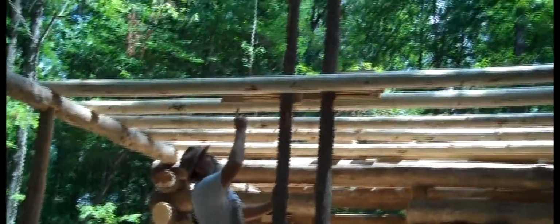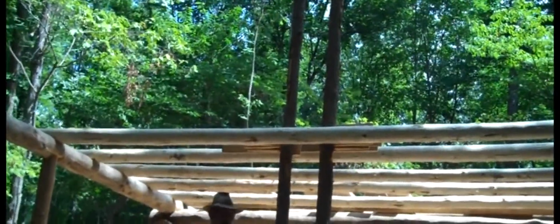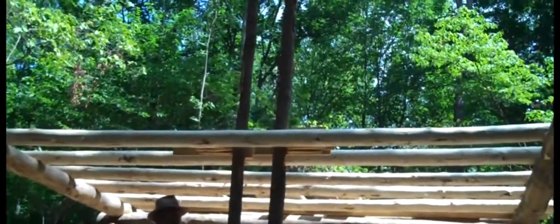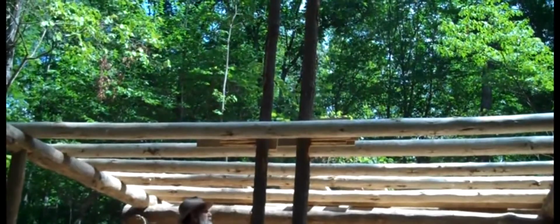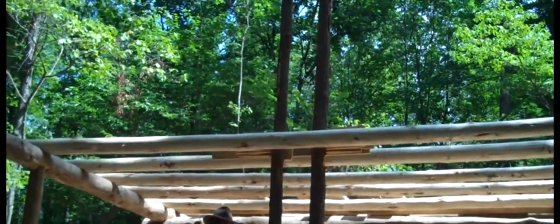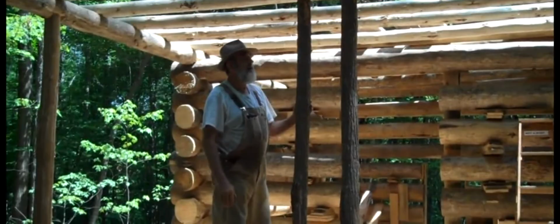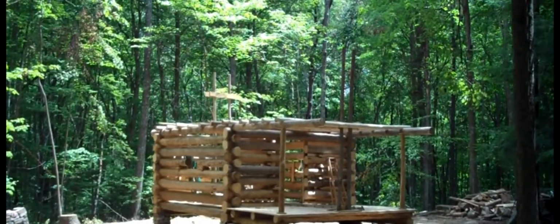We'll go up about 4 feet and nail us a cross piece for that ridge pole to set on, and get all that stabilized, and maybe put us a brace or 2 from the ceiling joist up to the ridge pole. Then we can start laying our rafters up on the ridge pole and have everything stabilized. Brace at the back of the cabin is installed.